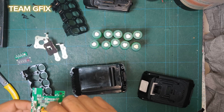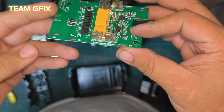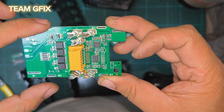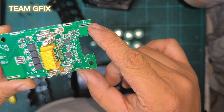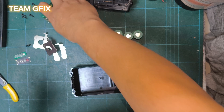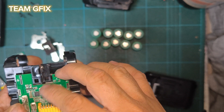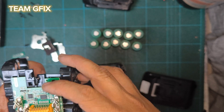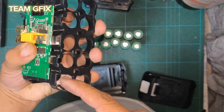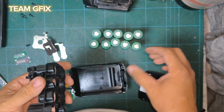The first step is to identify your board. On this board there's B minus, B1, B2, B3, B4, and then B plus. You're going to check the orientation on the holder. You'll notice that the B minus is right here — this is your total negative. So the orientation of your battery will be like this.